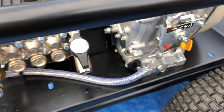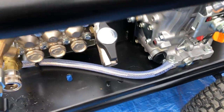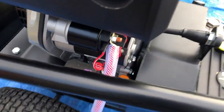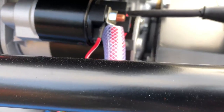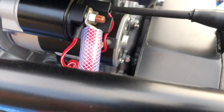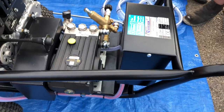If the machine is not being used for a long period, it isn't a bad idea to simply disconnect the cable. You can unscrew there with a 13mm. We've made this cable so you can pull it over and disconnect it live from the system, then put it back on. That way it protects the battery and doesn't drain it at any stage.